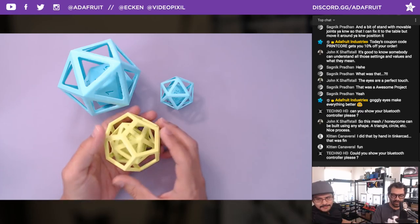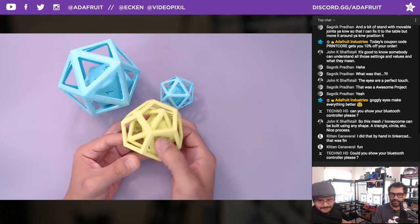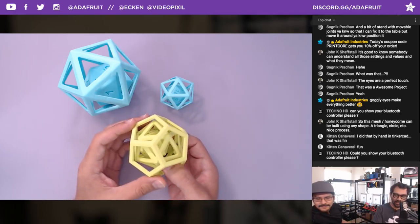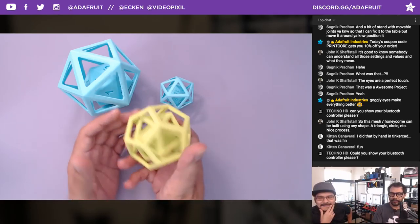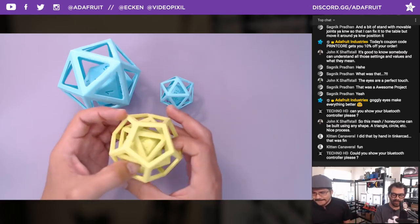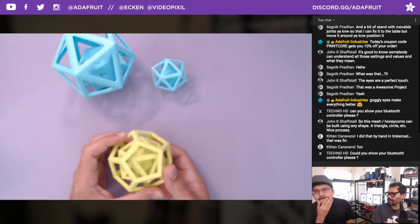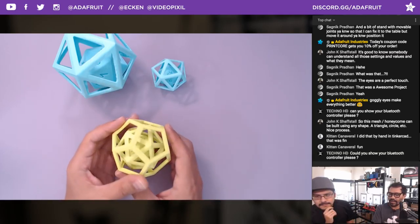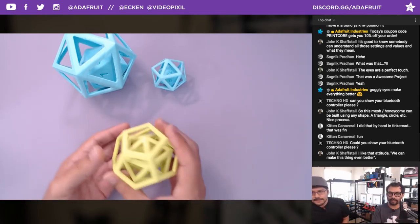So this is really showcasing the power of the small extruder and, of course, PVA to get this to print in the air without having any support materials that are going to ruin the part inside there. Got some really good slow motion video of this. This will be next week, actually talking about the procedures we were using, like an ultrasonic bath to get all of the PVA quickly out of there. Yeah, some nice techniques for that.